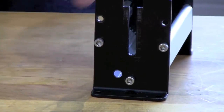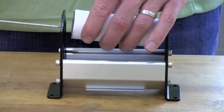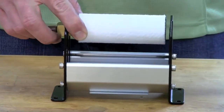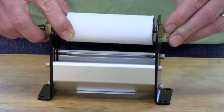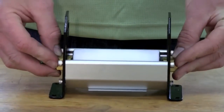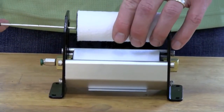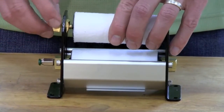When installing the new roller assemblies, it is important to verify that the holes in the dispenser tube are facing up. This will prevent any drainage out of the dispenser tube between valve actuations. Once the dispenser tube holes are positioned correctly, insert the dispenser tube through the square hole in the end plate and then into the bearing hole on the roller assembly. Line up the groove in the dispenser tube assembly with the slot in the end plate and hold in place. Insert the stub shaft through the square hole on the other end plate and into the bearing on the other end of the roller. While holding the dispenser tube assembly and stub shaft, line up the grooves with the end plate slots and slide the assembly down to the bottom of the slot.